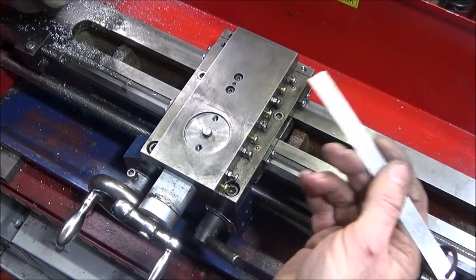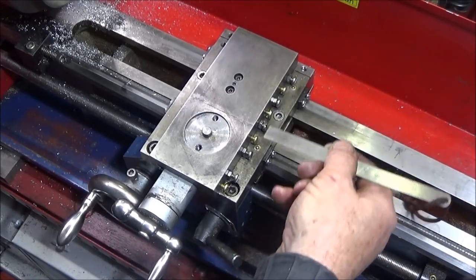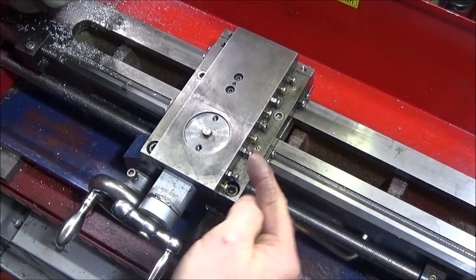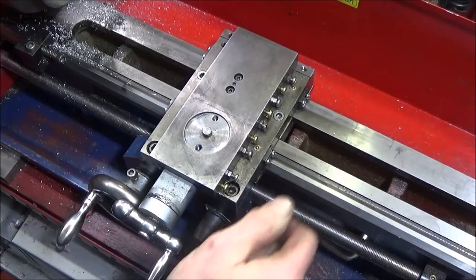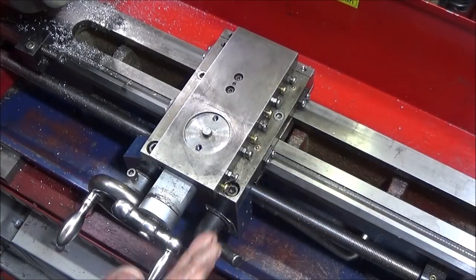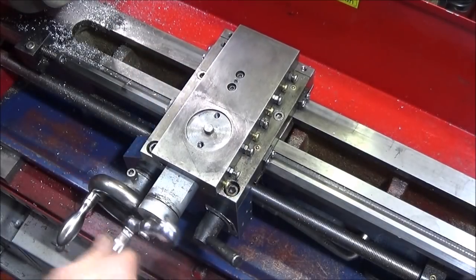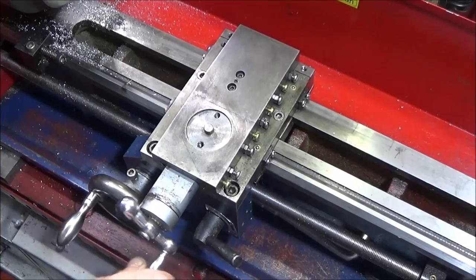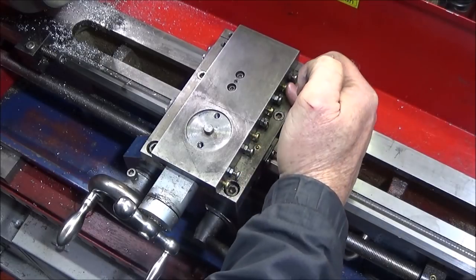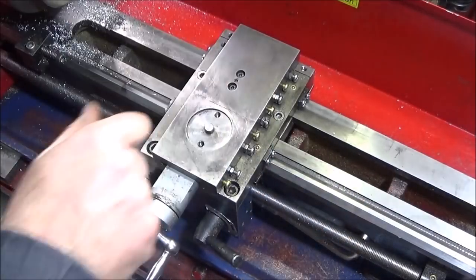In an upcoming video I want to show how to do this upgrade — putting extra adjustment screws onto the gib strip. The cross slide on this lathe only had three gib adjustment screws, which isn't enough; the Myford has a lot more and I've copied that idea onto this one. It makes the adjustment much more even with no tight spots and really smooth movement, no lift at all — great for milling. I've also added free-movement screws without a lock nut that can actually lock the cross slide when doing vertical milling.